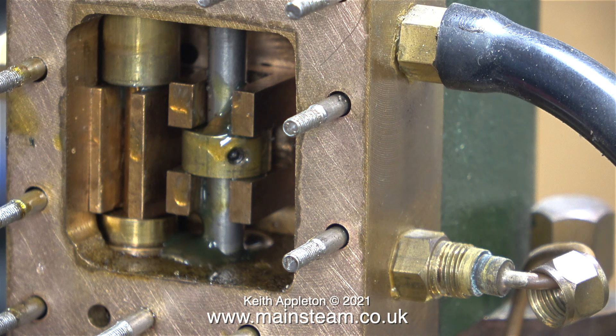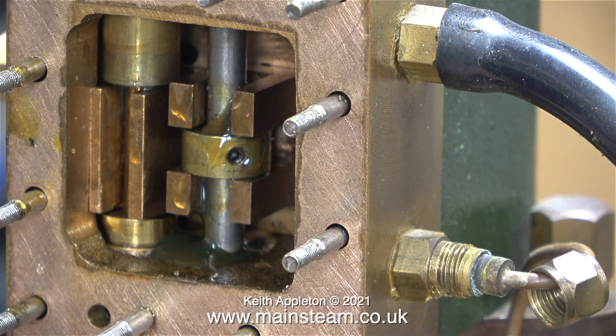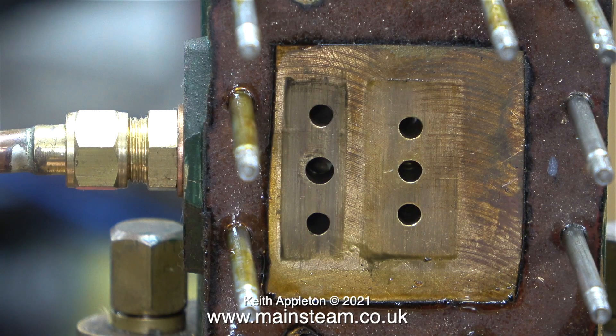I've had two or three of these pumps that Don's made and they've all been different. I really do think he likes to experiment, and quite rightly so — Don is an excellent model engineer and he tries things out just to see what happens. The Southworth 12-inch pump that feeds the water into the Castle V6 boiler is a horizontal one, and the water chest valves had to be extensively modified for this to happen.